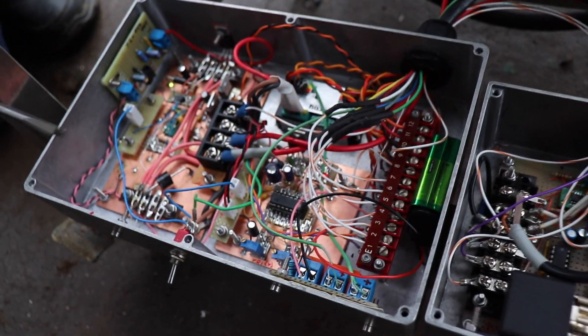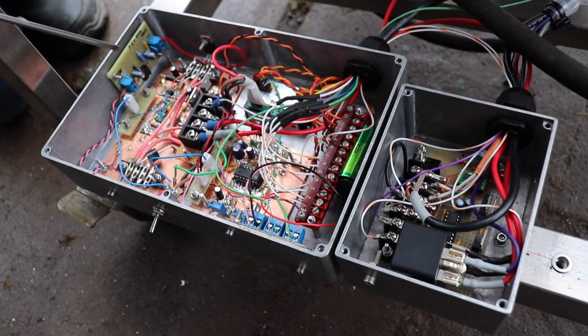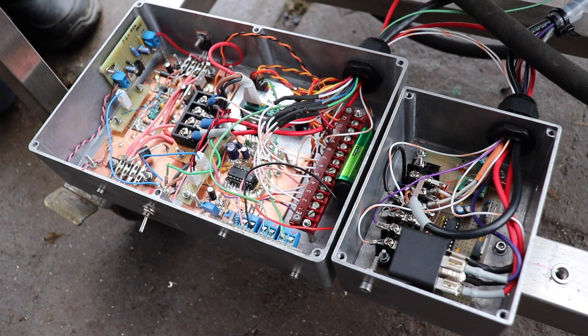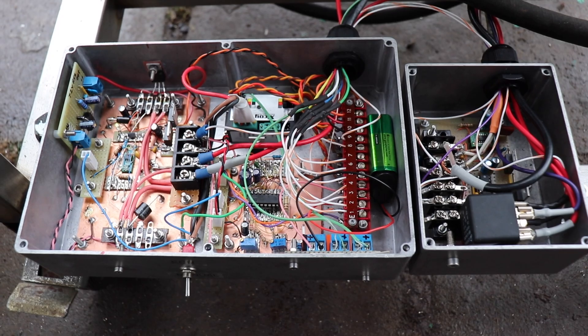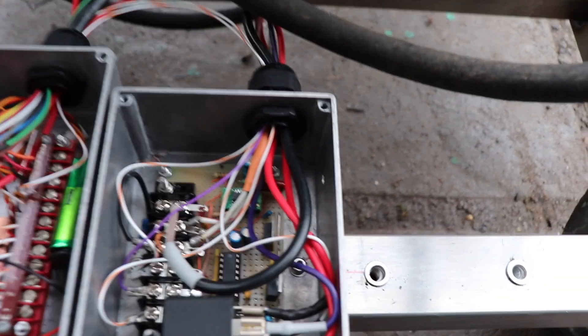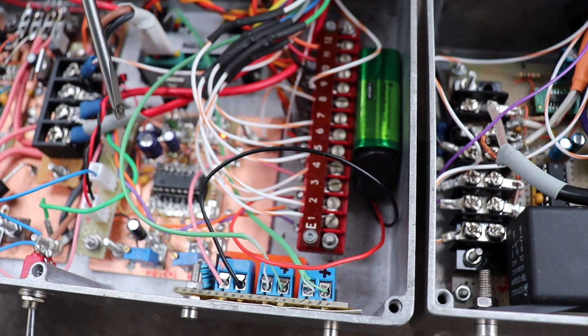What we've got here - though it looks quite daunting, it's actually not that much. The first thing is, this board here is basically a motor controller. You've got two MOSFETs which are basically controlling the speed of the fuel pump motors. This part here is just a normal PWM motor controller, which I've made using, as Paul says, our old friend the SG3525.